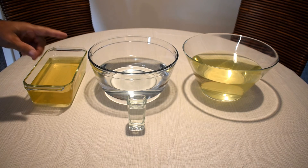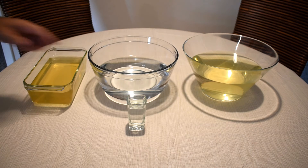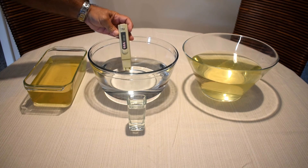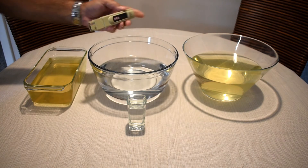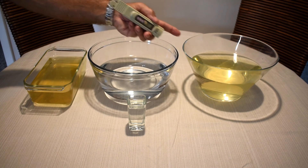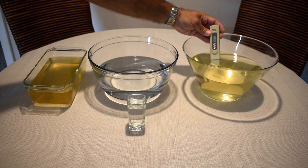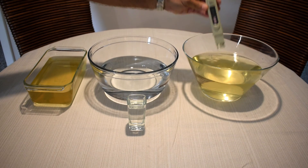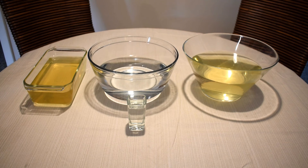You want to make sure it's at least a 90% reduction. So from that input level of 345 ppm, we want to come in at no more than about 37 parts per million. Let's take a look — 18. That is excellent. It says 019 now, so 19 parts per million. Very, very clean. And the wastewater here should have more dissolved solids than the input because it's going to have the rejection water mixed in — and yes, four, five hundred parts per million. So this is rejecting way higher than 90%, probably 94% or 95% of the dissolved solids in the input water.